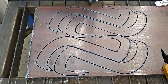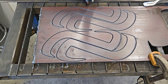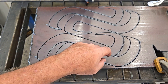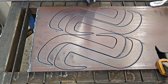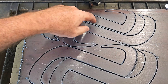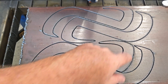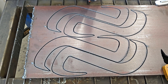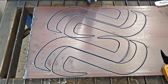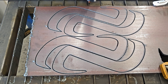That is very hot — not touching anything yet. But as you can see, I maximized what I could get out of that piece of metal. Right here where I nested these two they're kind of close together — it didn't seem to cause any problems but it's probably closer than ideal, almost cutting on the same line. That one little mess-up on the first cut — maybe don't believe the specs of your plasma cutter: if it claims 47, maybe go with 40, which is what I did.